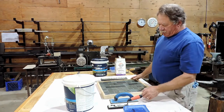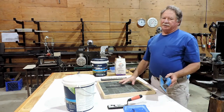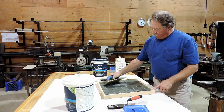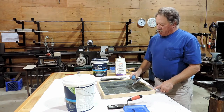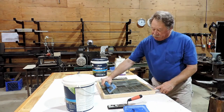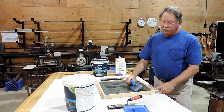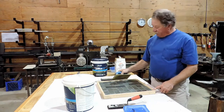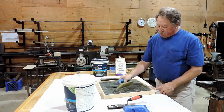Once we've got that done, we're going to spread our grout. You want to spread your grout with your grout float at a 45 degree angle to the joints. What you don't want to do is spread parallel to the joints where you're catching each joint with your grout float. So you want to come at an angle — it doesn't have to be exactly 45, just close to an angle to these joints.